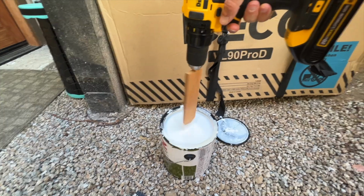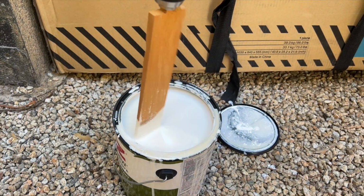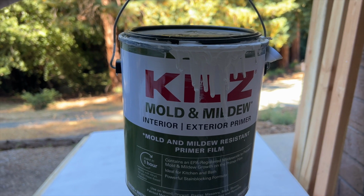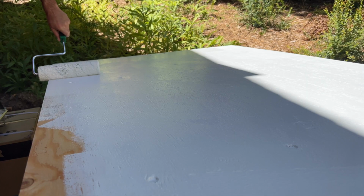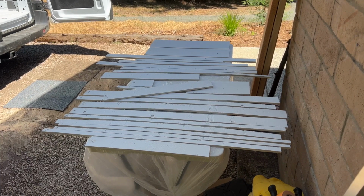Step 1 is to water seal your 1/2-inch plywood that we're going to put into the channels as a base to screw into. There are various products that seal wood, and there are a few considerations to take before you decide on what the product is, but the main consideration is dry time. We used a mildew resistant primer, which was awesome until it took 3 or 4 days for each layer of paint to dry, which was crappy because it took so much space in our work area to let these pieces of wood dry.